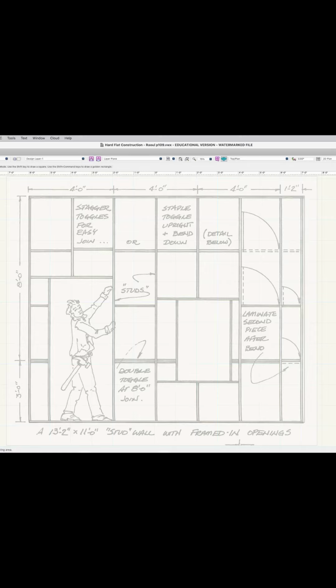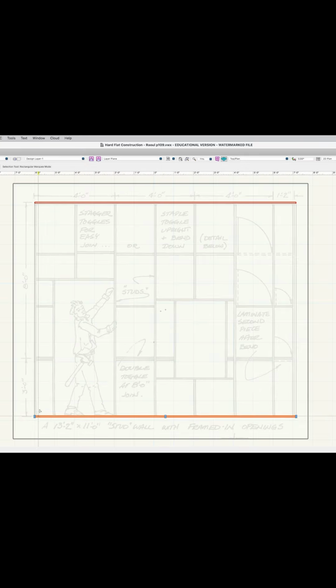As for improving the structure of the larger flat on page 109, the outer framing is fairly correct with the top and bottom rail and the two outer studs between them. But the detail on the bottom rail spanning the opening of your doorway is in fact your least elegant solution. You do need a sill iron of some sort to keep the door opening from wishboning during transport and installation.